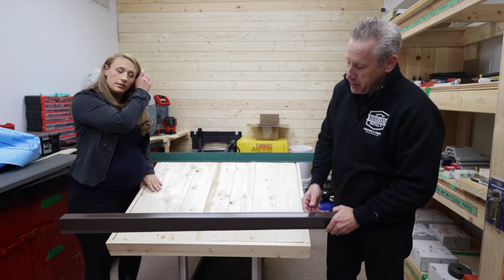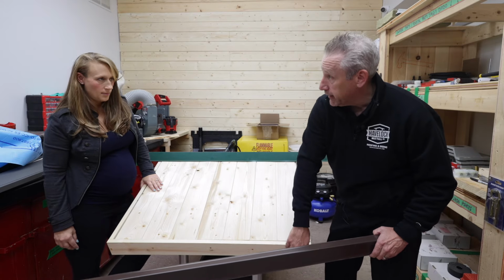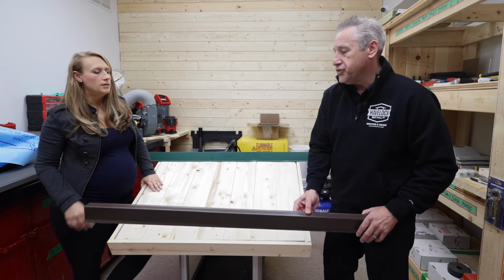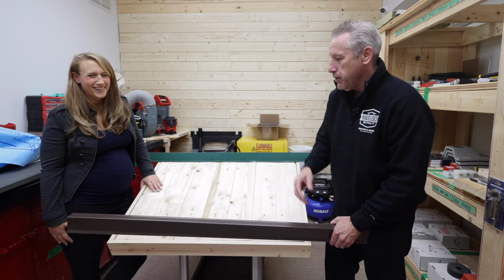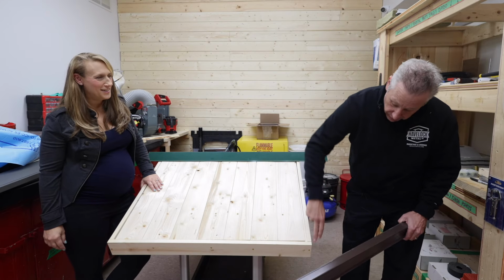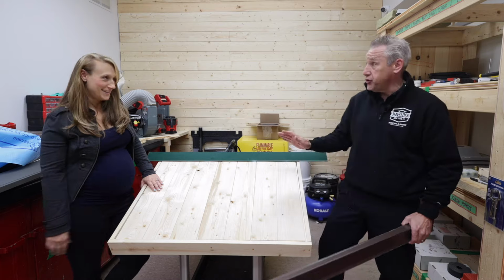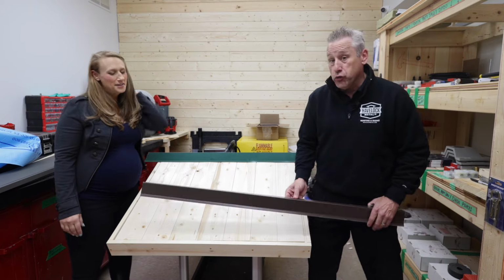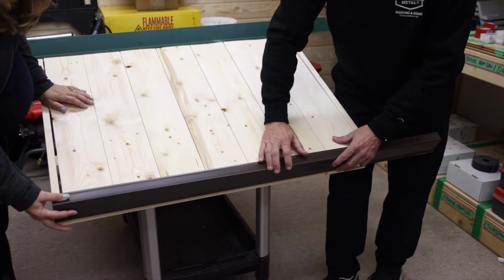The reality is basically you're just trying to create a wick edge so the water drips away versus back against it. What's odd about calling it a gable starter is it goes on an eave, which doesn't seem to make sense. But that's because in homes, this piece is typically vertical to match the wall. But the Bunkie finishes at 90 degrees, which makes your life really easy. So we just use the gable starter there because it's 90 degrees. It would fit just like you see it there.